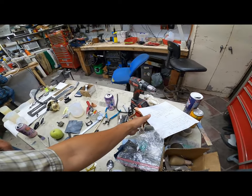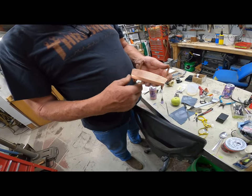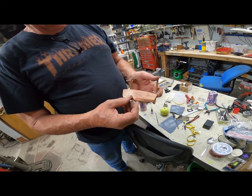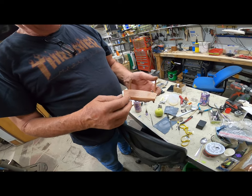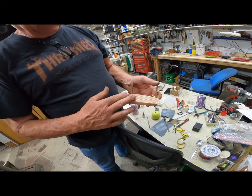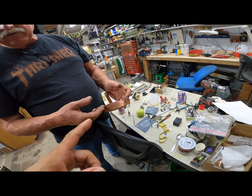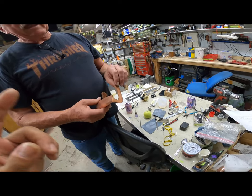What about this door handle? This is an Alfa Romeo door handle. The problem with die cast is that it's like a sponge. We're actually replating just an original. The way you do that is you flash copper it, then fill all the voids with solder, then put more copper on top, take it out, fill it with solder, put more copper on top, and then file it, scrape it, and reshape all the lines. That was originally a zinc die cast alloy.